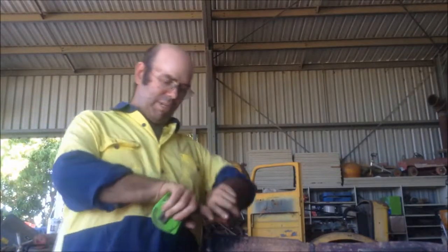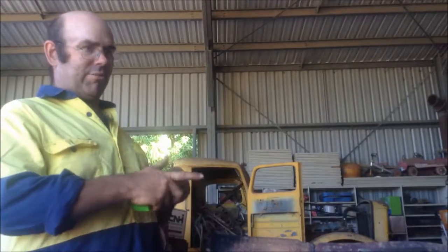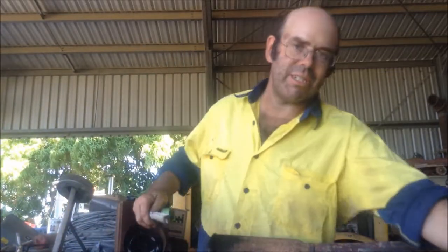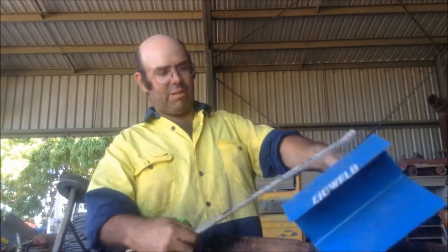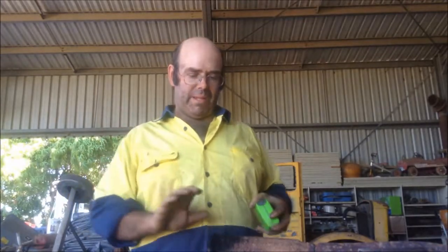So then by the time I bend it up at each end, I need 11 inches if I was to go all around and meet up, but I want a gap in the middle, so I'm only on about 10 inches long. I want a gap so you can actually clamp it up tight. Just so happens, this is about 10 inches long. Have to cut another bit off, which will be off this other crooked side, and that's so when it's got that 1 inch gap the bit slides into it.